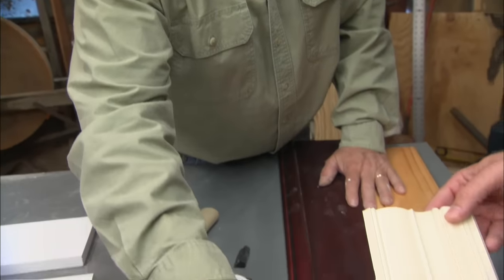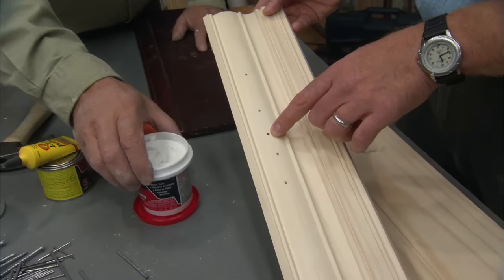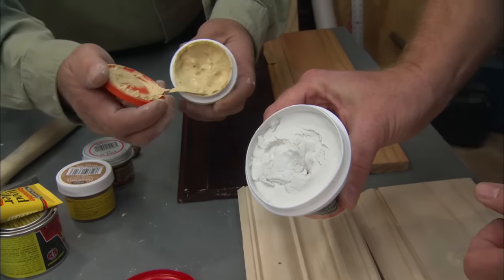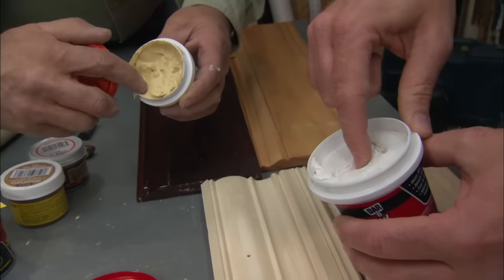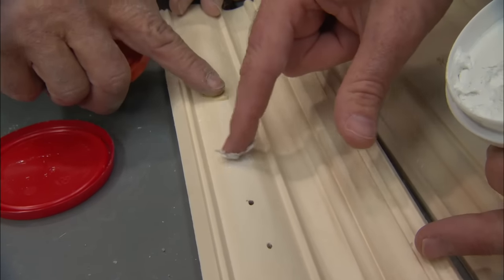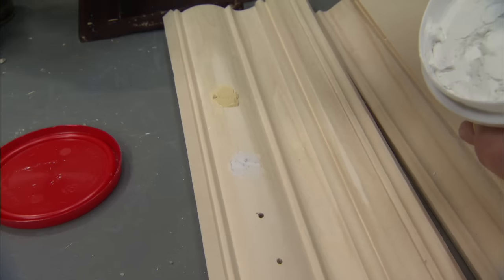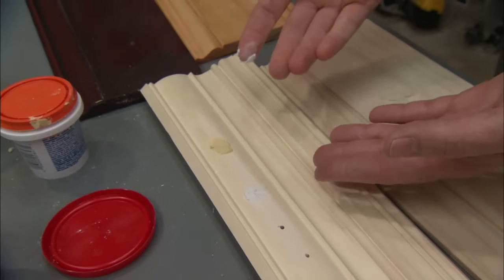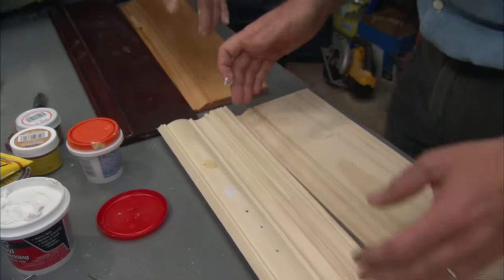Let's say we're inside the house and we're going to paint the wood. We've got a piece of crown molding right here that hasn't been painted — it has some nail holes. You can use a vinyl spackle or a water-based wood filler to fill the hole, but you always want to overfill it so it shrinks down when you sand it. Because we're going to sand it smooth and then paint it, it's pretty forgiving, so what we choose isn't that critical.